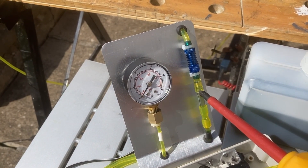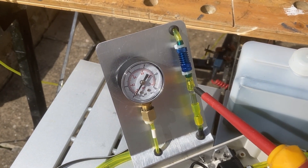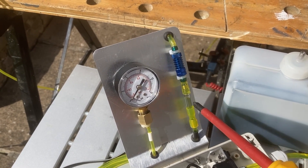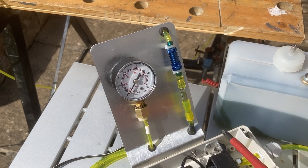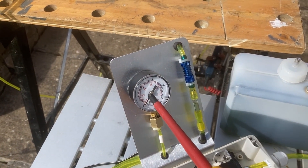The restrictor is a 0.4mm diameter hypodermic needle and the injector is a 0.6mm ID hypodermic needle, so there should be about 1% of the main fuel flow going through here — we'll see what happens. And then just a pressure gauge from the pressure tapping in the engine.